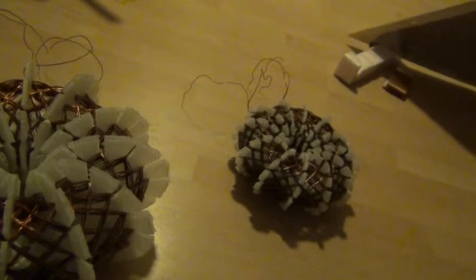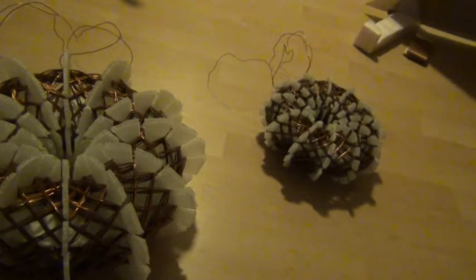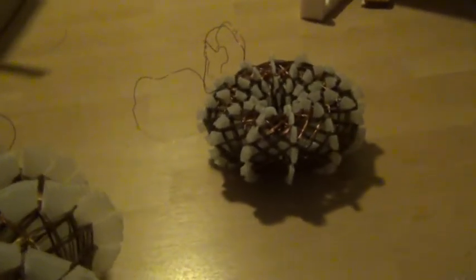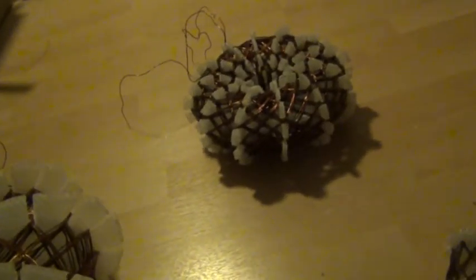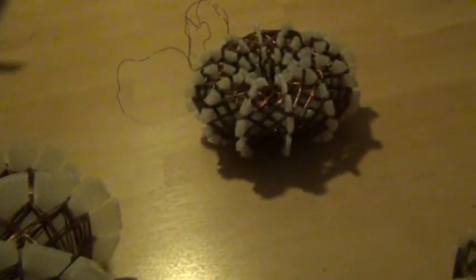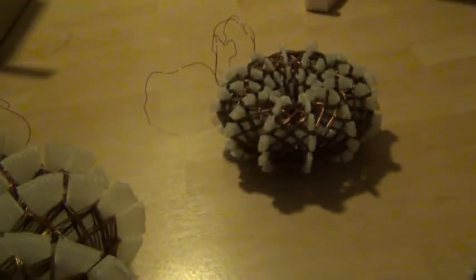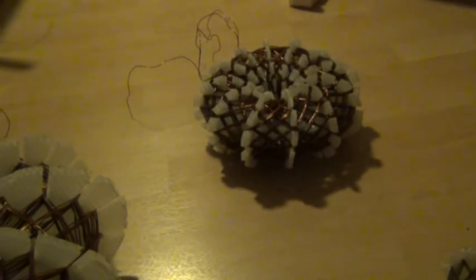The effect of using a smaller one is slightly better efficiency, it seems. But other than that they work just as well. And the frequency on this one, which has three repetitive patterns — like this has one, four and three — can work on 300 kHz, I believe it was. And this one works slightly better than this one, even though it has one less. But it's smaller, so it seems that smaller coils actually work a little bit better.